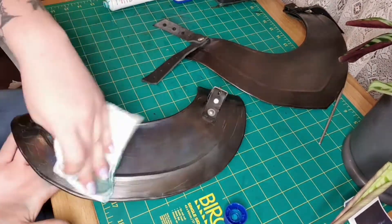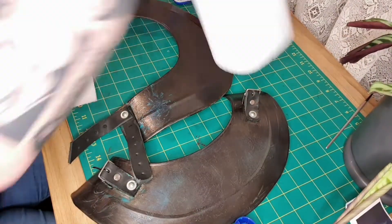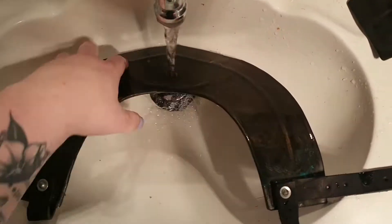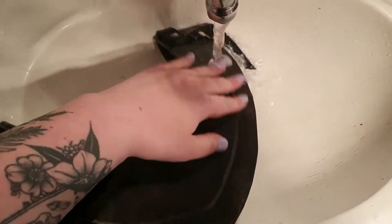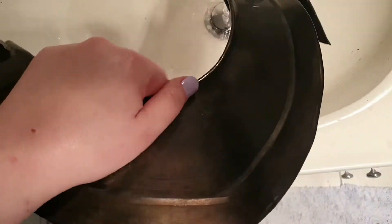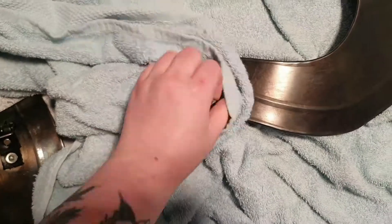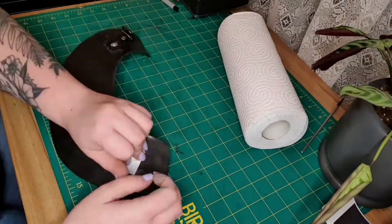Now the first step that I completely didn't film was the cleaning process. The reason I didn't film this was because I started doing it and then thought I should film this and make a YouTube video out of it. However when I did start, it was silver. The product I actually use is a bluing for guns. With this bluing paste you have to thoroughly clean it off the metal once it has activated. I literally did that in the sink in my bathroom and then towel dried it. Being metal, you have to dry it really well, as the bluing paste is actually a form of rust, so you've got to make sure you clean it all off really well and then oil the armor afterward. However I didn't oil it straight away simply because I did want to paint on it, so I just left that step out.